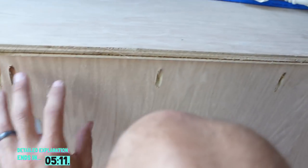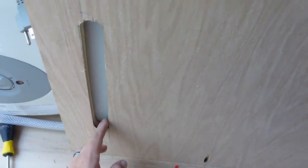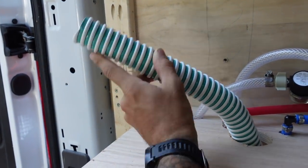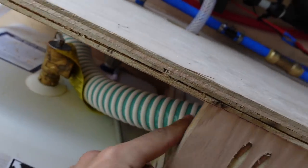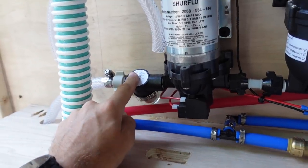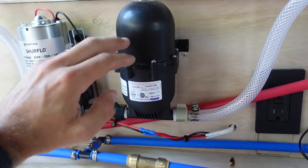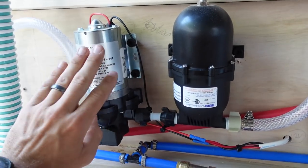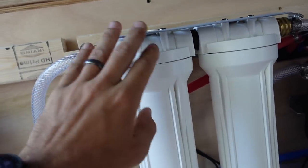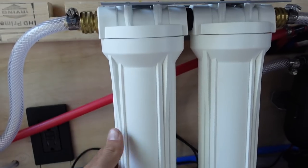In this compartment we have a 30-gallon water tank molded around the wheel well. I cut a little groove so I can see the water level. This pipe attaches to the wall and is where water comes in to fill the tank. Water is then pulled from the tank through a filter, through the water pump, then through the accumulator — which has a diaphragm to keep pressure consistent, making the pump quieter. The water then goes through two KDF filters from the RV Water Filter Store as our first barrier of defense.